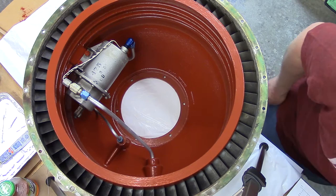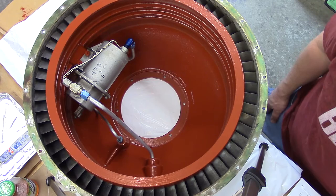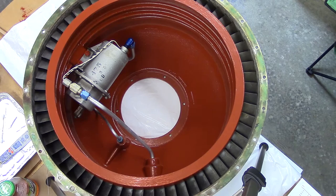It has a torque specification for those two screws. It's called a bolt — oil mist lubricator. The manual is specifying 100 pound-inches minimum and 120 pound-inches maximum. Let's get reading glasses so we can see the little numbers. Take our trusty Snap-on torque wrench and we will set it to 110 pound-inches. I always dial up to the setting — it's been stored with it set to zero, all the way as loose as it will go. Right there is 100 pound-inches, so we'll go one more revolution, which gives you 110 pound-inches. Locked.